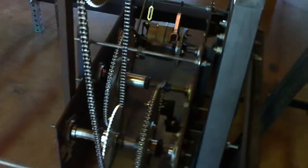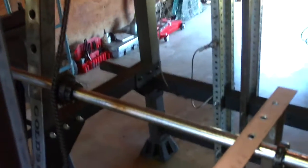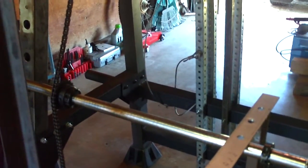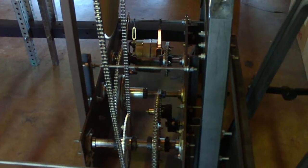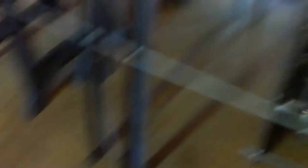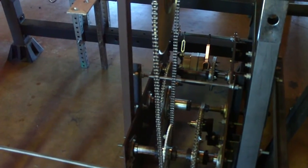The video really doesn't show everything. The gearbox is so much more solid over here. I ran some weight actually about a couple of weeks ago and the gearbox moved really well — things were very cool. I was very pleased by that. I learned a lot running that weight; it led me to understand some things about chain tension and slack, and so I made some decisions to put the gearbox in here. What's really cool about putting the gearbox in here is we have a smaller footprint — we don't have the gearbox sitting out here. So this is a more condensed, smaller footprint package.